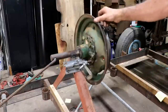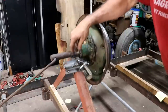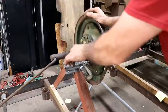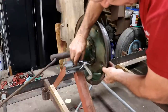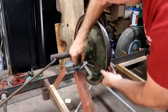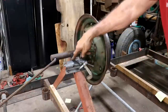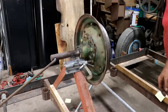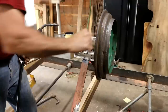The next obstacle was how to keep this thing from moving. I found an old latch — this latch was pretty much destroyed and I just re-bent it and made it work. Like I can lock it into every hole, and where a bolt is, 180 degrees from there I can lock it in and it serves the same purpose. I think it's almost foolproof. So I'm going to go ahead and just tack-weld this in place and I think that's going to serve my purpose perfectly.